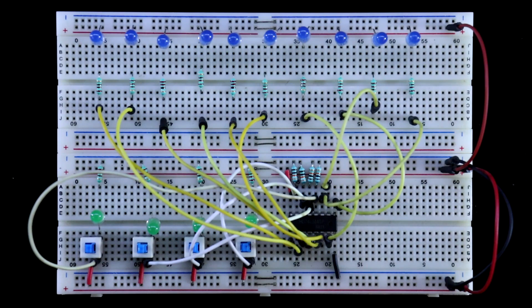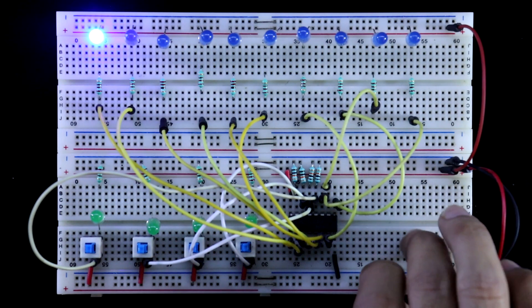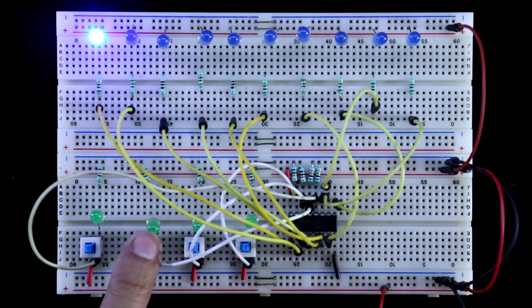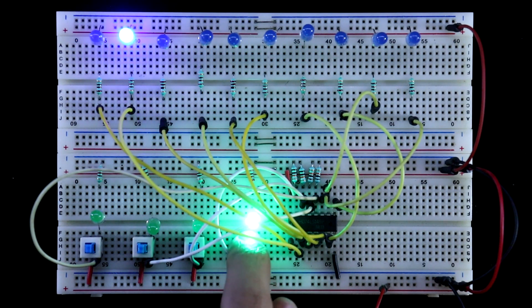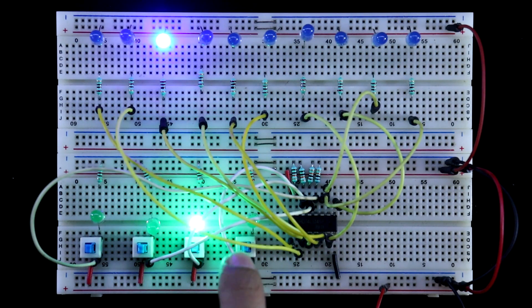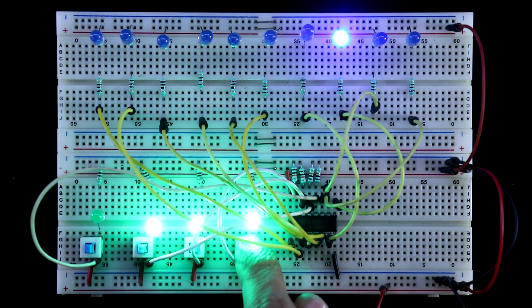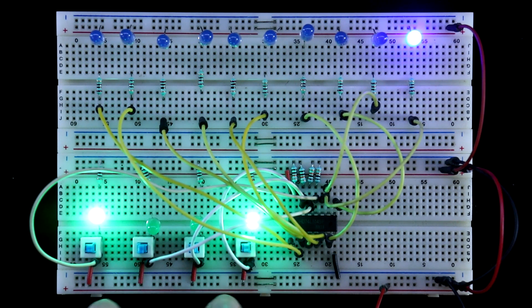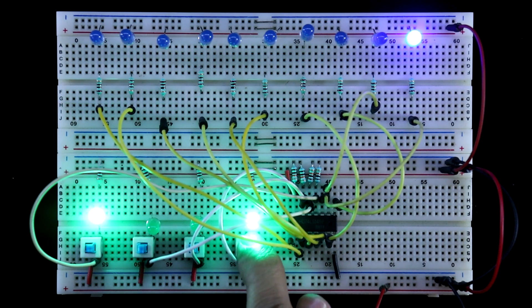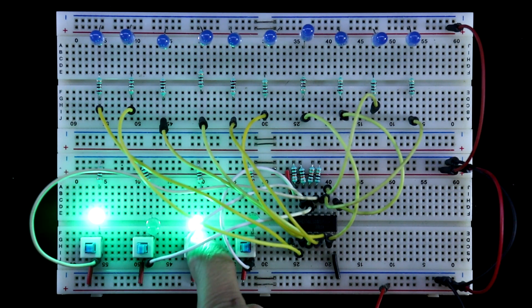So this is how we have completed the connection. Now I am connecting the power supply - negative and 5 volt positive. With input 0000, Q0 lights up (LED 1). Then 0001 is second, followed by 2, 3, 4, 5, 6, 7, 8, and 9. So this is BCD to decimal, or you could say it is a kind of 1-of-10 demultiplexer. When the input is A (1010 or above), no LED is glowing, so it works only up to 9. This is the basic thing we need to know about IC 74145.